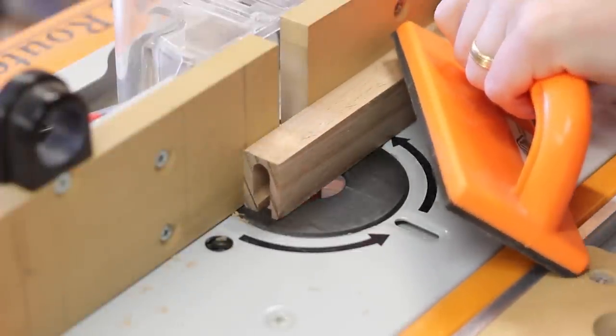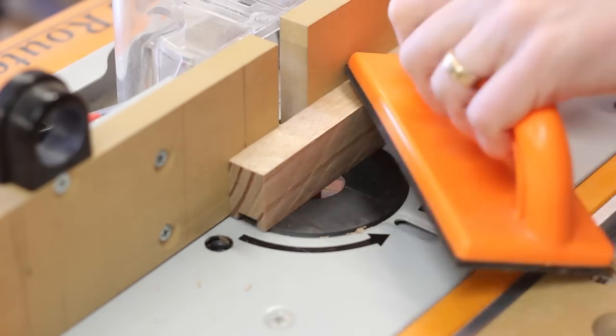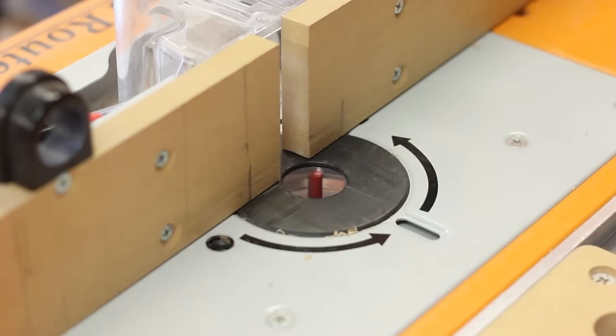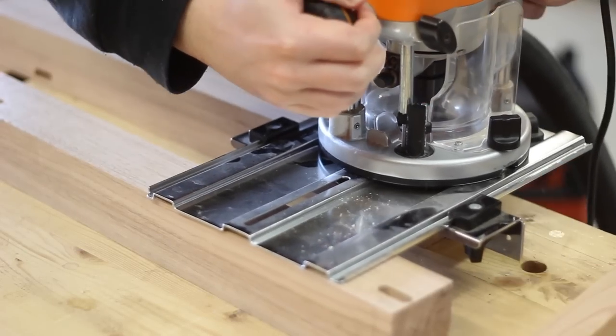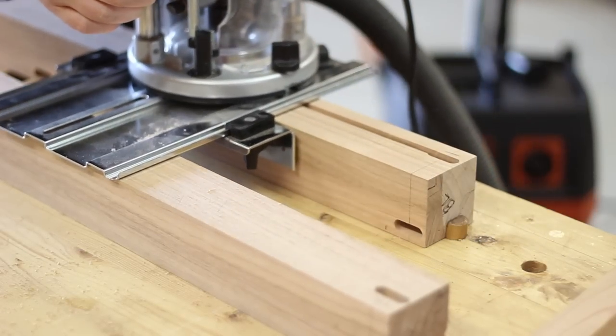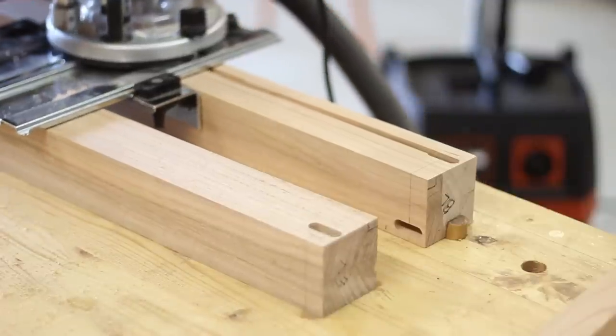Because the sides of the TV unit will have panels, grooves are cut on the router table in the short aprons. For the grooves in the legs, the router is used out of the table. I'm very seriously considering getting a new router as the edge guide on this one is absolute garbage and I'm becoming a little bit more frustrated with the brand.